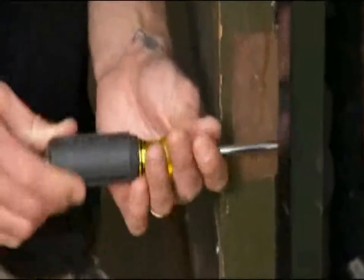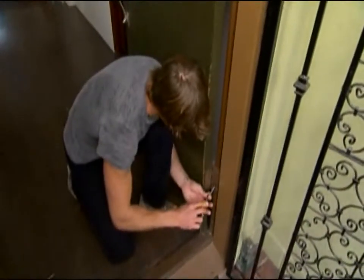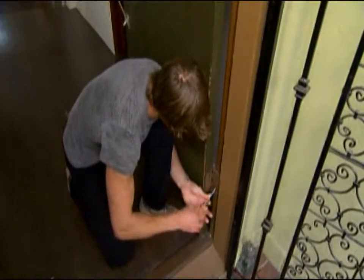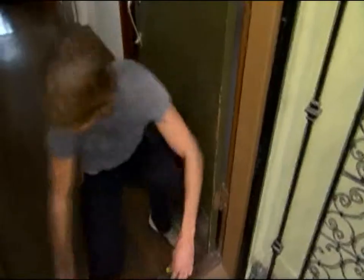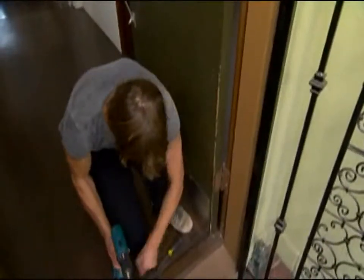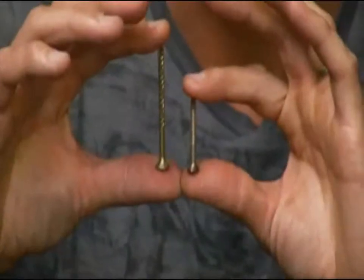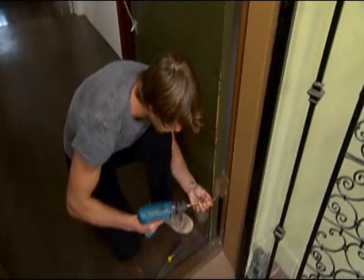You see that screw? Look at that — it's completely stripped. That means all the wood in there, it just doesn't do anything, it's not holding on. So what we'll do is we're actually going to replace that screw with a longer screw. You can see how much longer it is — just almost twice as long. So you'll be able to get in there and get some new wood. It'll hold in there tight.